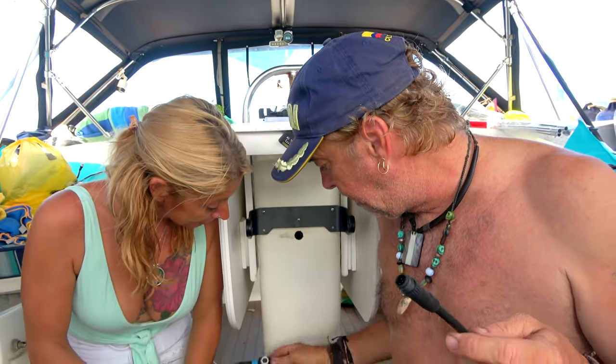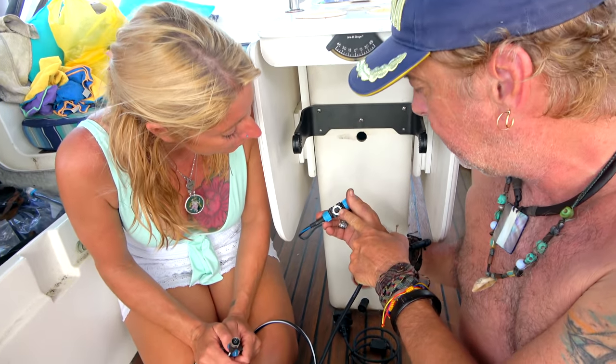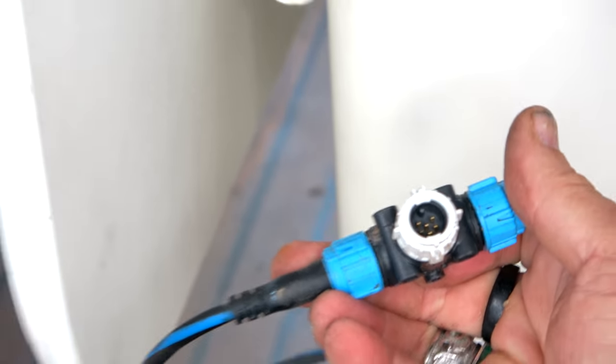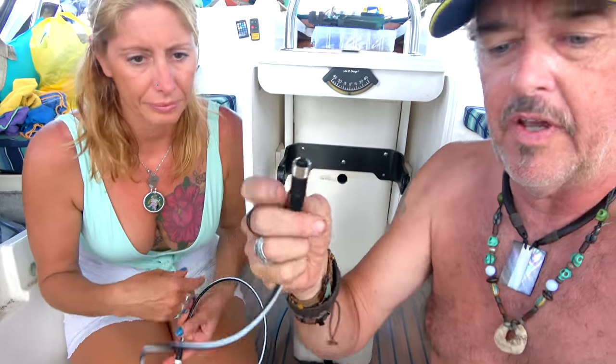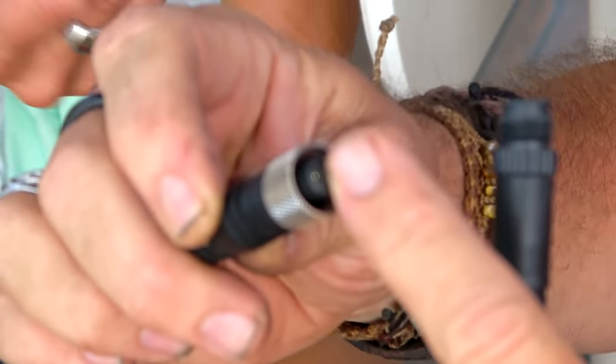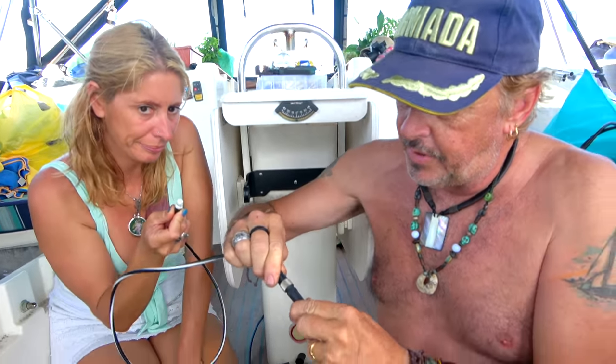This cable has two components: the power wire itself — basically a positive, a negative, and a shield — and then this adapter for the SeaTalk connections to the rest of the Raymarine network, which includes our wind instruments and everything over at the helm station. This doesn't plug directly into our network here; you can see it's a six-pin connector inside, and this one has a five-pin, so there's a bit of difference. That's why they have this adapter cable available to interface with any of their systems regardless of age — it connects the five-pin to the six-pin.